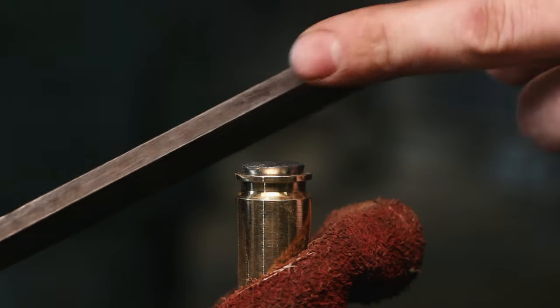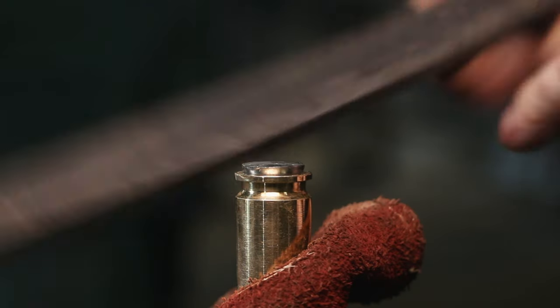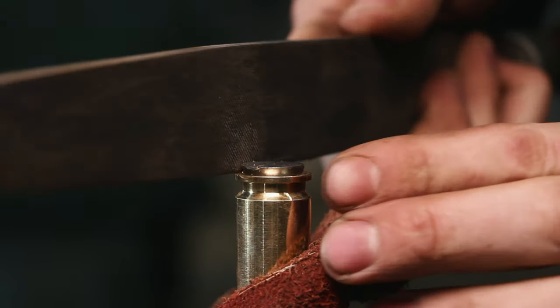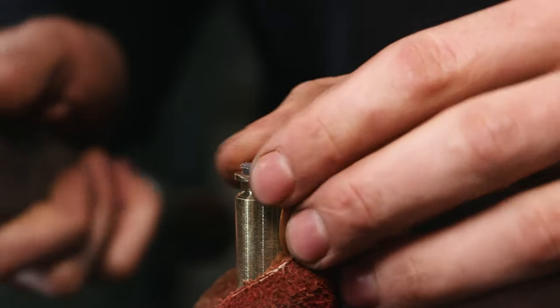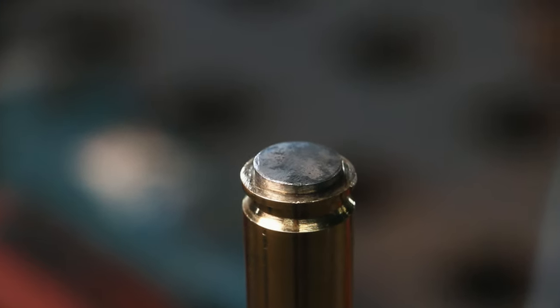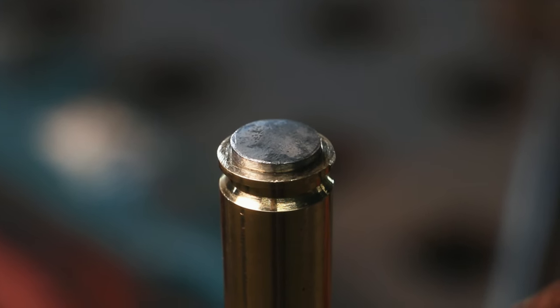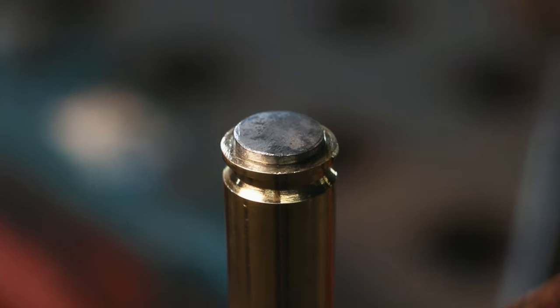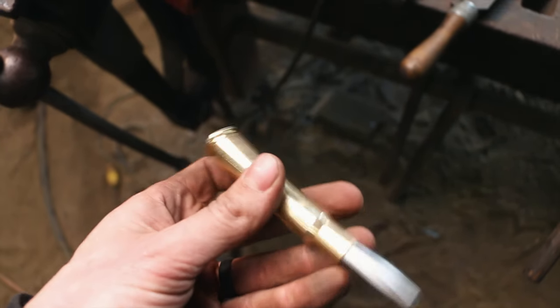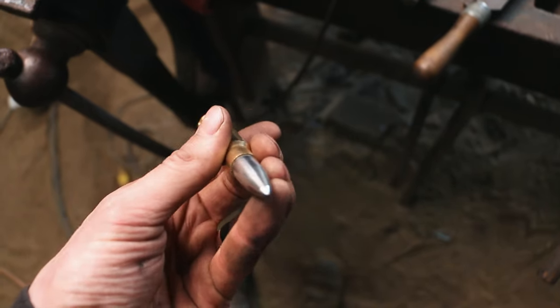So this is a file that's got a safe edge on it, which is important. We're going to put that on this. There it is filed up and I'm really happy with how that went. It files very nicely. I put a little bevel on it too with the file. I think we've got a pretty good tool here, guys — I'm so stoked. That end is impressive.